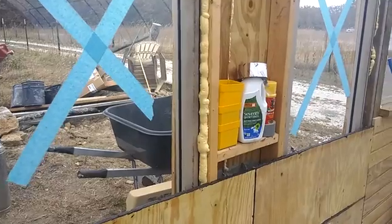This is not a good type of mixer to use — you want one with a spiral attachment. Even with a drill, that type probably wouldn't be great. With a good heavy half-inch drill and a spiral type mixer, you could do a good job. There's one on eBay for $53.10 and I've got that coming. That's going to be our preferred method, especially since we can take this wand — they call this a foam lance in the industry. We can hook that up to an injection system and inject the foam right down at the level of the concrete at the bottom of the barrel so that the foam rises, the concrete sits, and they mix together. With the spiral thing coming up, it'll do a fabulous job of mixing.